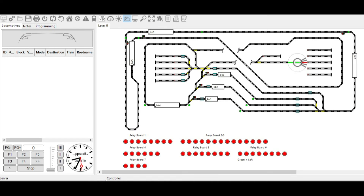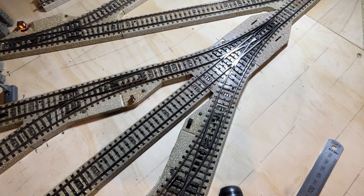What is an ESP or a digital input isolator and what would I use them for? I was about a quarter of the way through my initial build and decided I wanted wireless points control — still like the old-fashioned push buttons but using my phone instead. I already knew about ESPs and wireless control. This is about where I decided that I would use Rocrail to do the control for me. This clip shows some of the points changing and being controlled from my PC when I first got everything working the way I wanted. All of my automation is still 100% analog and would run without any of these wireless bits and pieces — it was more just for the play aspect and a bit of fun. It also meant I only had to do limited cable runs for the control side, with only seven wires linking the controllers to the main train board.